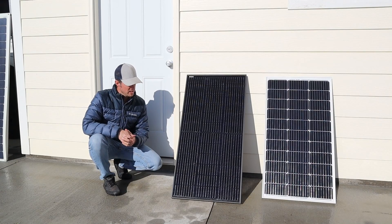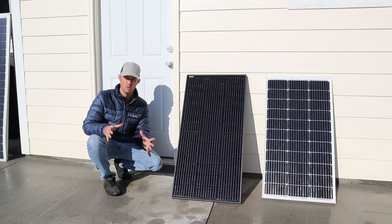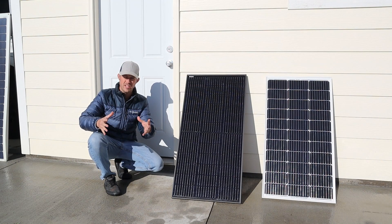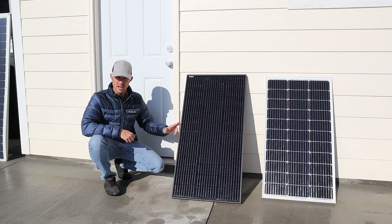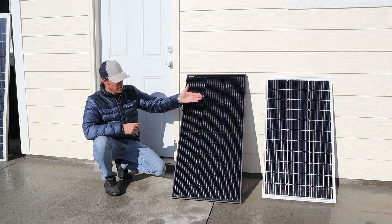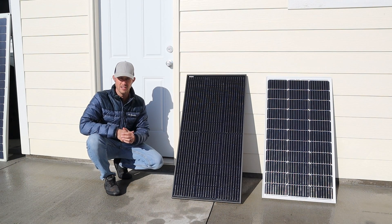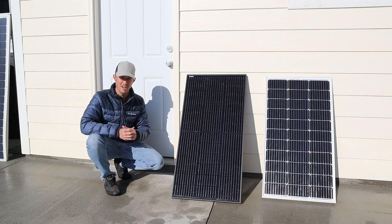When is it ideal to choose a panel like this versus a regular solar panel? Think about situations where you have very limited solar install space — like the top of an RV or a small trailer — but you have a lot of shading from an AC unit or other vent systems. You're going to get a lot more power over time with this type of panel and also avoid damage like hot spotting that you get on a regular solar panel. Definitely recommend it for partial shading environments; if you have no shade at all, a regular solar panel is fine.